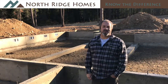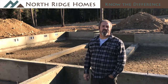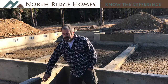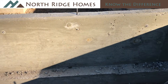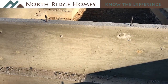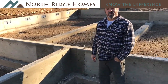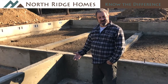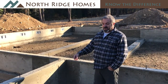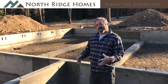We're back here on the Sage Creek Cottage. As you can see behind me, the footing and foundation have been poured now. You can see how smooth the wall is, and that's from using the vibrator and condensing the concrete. You can also see how smooth and sealed up the foundation is from our form system and using the vibrator to condense the concrete. That will also help prevent water and moisture from getting into the concrete and expanding and deteriorating it.